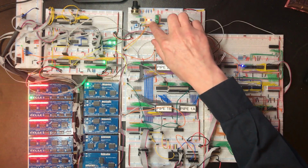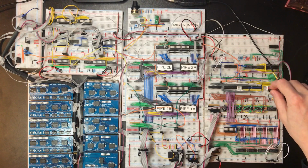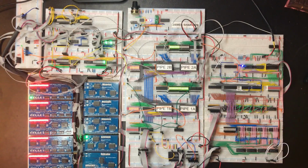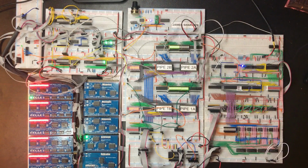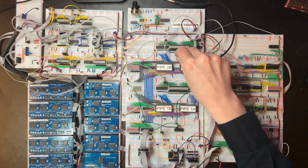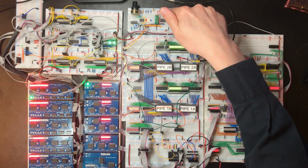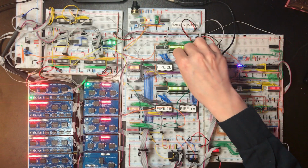So I plug the power in, it flashes on briefly, but I have noticed if I move the power around and put it in elsewhere, the reset line stays on, and that implies that the voltage level that gets as far as this chip has dropped a bit far. So it's going off and on a bit there. That implies that between here and here we've got a voltage drop that's fluctuating a little bit.